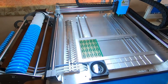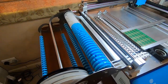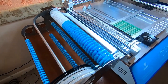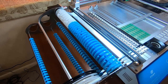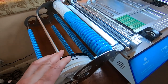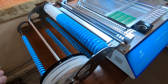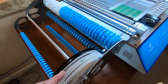So just a very quick look at the machine. It will handle boards up to about 350mm square and it's got 29 reel holders. One of the main things anyone familiar with bigger, more expensive machines will notice is this is where this machine varies most in terms of practicality and usage compared to an industrial commercial machine. In a commercial machine you have cassettes that you load the reels into and then slot into the pick-and-place machine. If you want to change a component at any station you pull its cassette out and put in the new one. Naturally you can't do that with this machine.